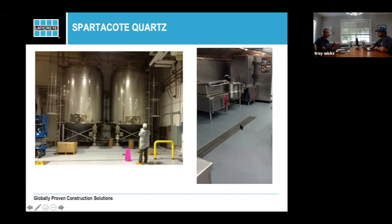When you look at the commercial kitchen off to the right, I like to point out the fact that you've got a trench drain. You were able to just blue tape off the trench drain. Because you have fall, if you were comparing to an inexpensive epoxy system, you'd have to worry about the material rolling into that. So you would actually find yourself having to do a thicker build epoxy trowel down system, which in the end becomes a lot more work, a lot more time. This particular system with the polyaspartics, tape it off, put out your base layer, broadcast your material into it. It's not going to run, it's going to stay exactly where you've left it.